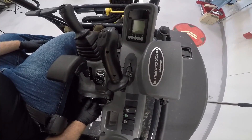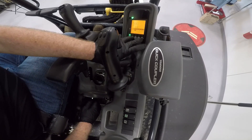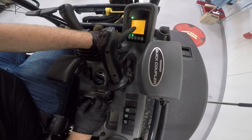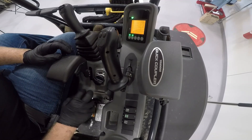make sure the hydraulic system is at operating temperature and the testing conditions are met. You can do this by turning on the switch and, within 10 seconds, holding the 1 and 4 key down while turning the light switch on and off. Then select monitoring — the hydraulic temperature will be displayed. It should be between 50 to 60 degrees Celsius. Make sure eco mode and auto decel are turned off.